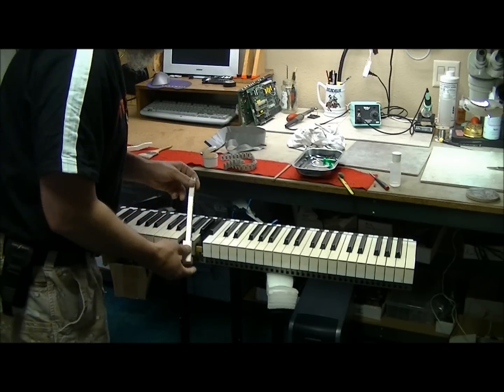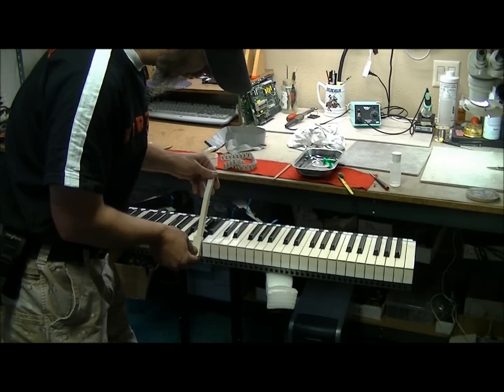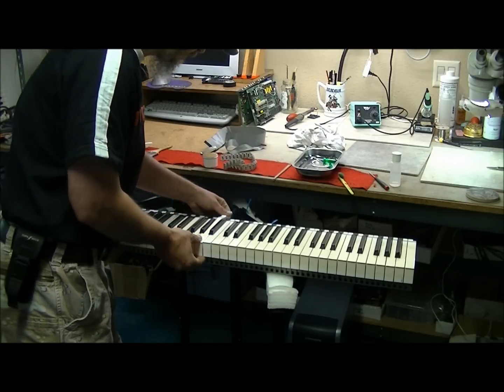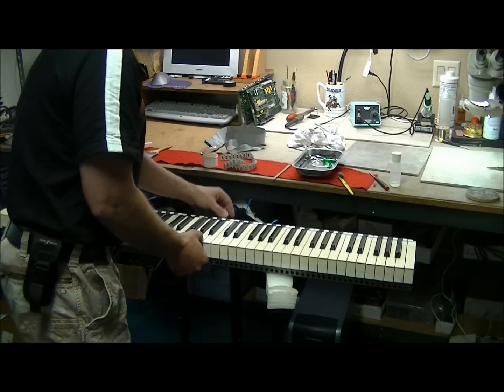Get this A key here. Stick it in like this. You want these hooks to go underneath here. So, like this. Down, slides forward, then from here, just let it fall down, go back into that pivot, clicks into place, and there you go. Then just add the spring.